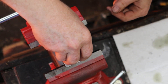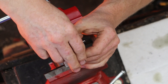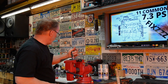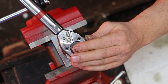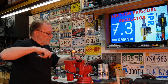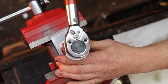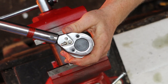Now you've got two alignment pins inside here and they have to line up, so you take it, set it in here, grab the nozzle - there you go, I'm on my alignment pins. Now I push down and I turn - I'm on the threads. Every kit you're going to get something similar to this to turn this down, and it's 75 foot pounds, 101 newton meters.